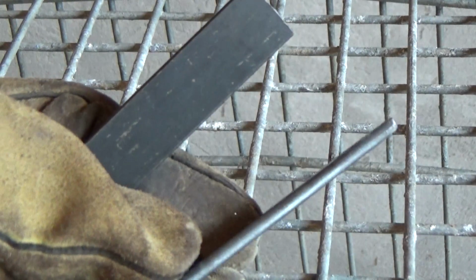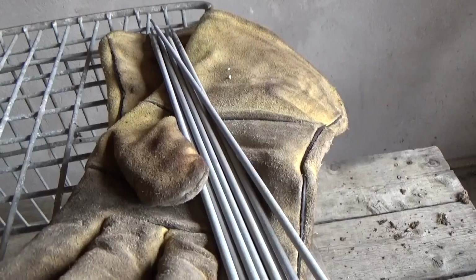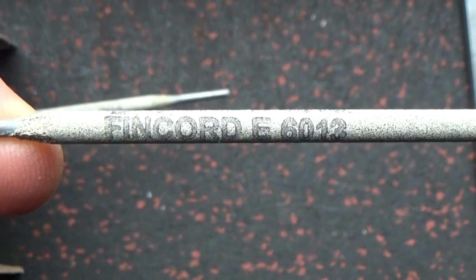I'm not going to discuss this complex subject. I decided to show how this can be done practically. This technique is used by almost all welders. What can we do? First, find a piece of metal of the same thickness as the welded parts. Second, make a few welds on a plate of metal with different currents. Third, choose the best.